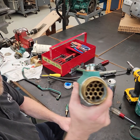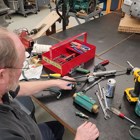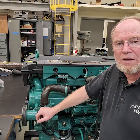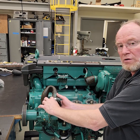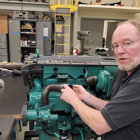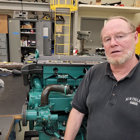These are a tube and bundle cooler, so you can see that a little bit better here. There are your two adapters that you need to make up to pressure test coolers like this. I hope this helps you understand how to take the fuel cooler off of a D4-D6 diesel. Don't forget that bracket when you're going to put it back together — that hose clamp has to go behind here to hold that cooler, and that's probably the easiest piece to miss. If you like the video, please subscribe and I'll see you in the next one.